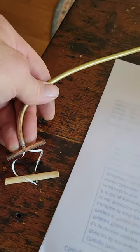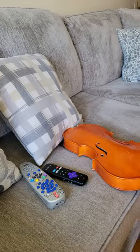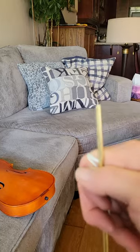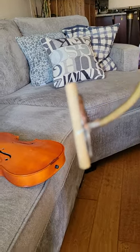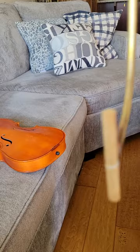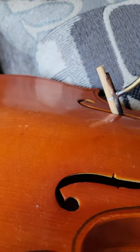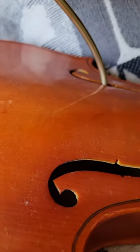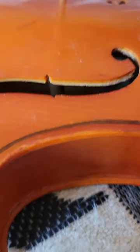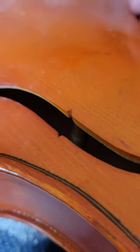This is going to cost me all of about ten bucks — I think the floss cost more. I've got a good firm grip; the floss is all wrapped around my fingers and tight around the post. As you can see, it's angled and pre-cut, ready to pop into place. I'm going in from the G side of the F-hole, finding that spot, wiggling it around, and as you can see, there's the floss coming through. I'll get that set.